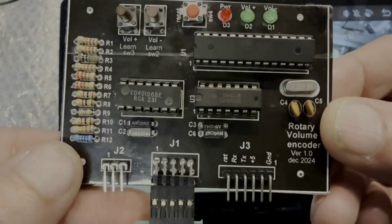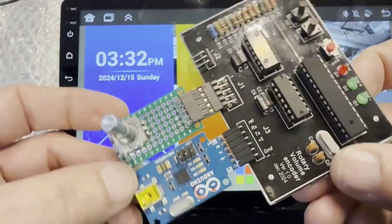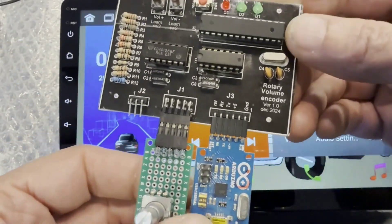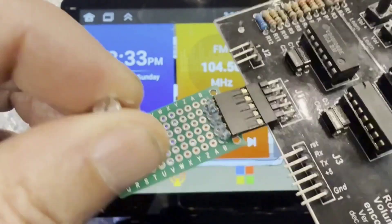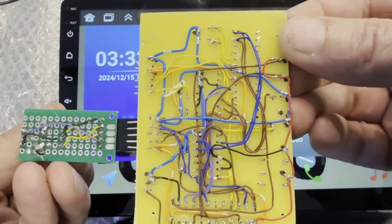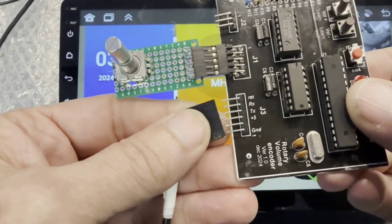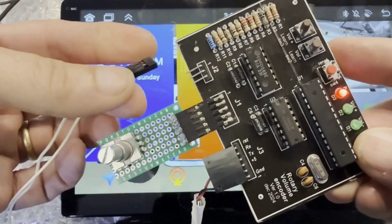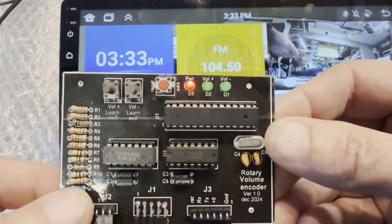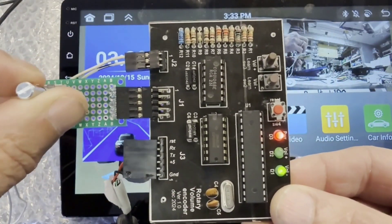This is my prototype PCB — the green perforated board — and it has the encoder switch 1 plugged into J1. The blue PCB is the FTDI interface in J3, used for programming the Arduino U1 and feeding the plus 5 volt power taken from the radio's USB port. J2 is connected to the radio key 1 input function, which is in effect the buttons from the steering wheel.